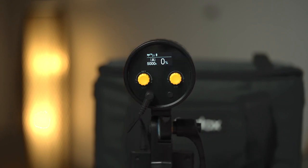This light is now mounted on the grip with two batteries. On the rear there's an on/off button, a power rotator, and a colour temperature dial. Power-wise, at 1% you can see the effect, and ramping it up to 100% it's extremely bright. Temperature-wise it goes from 2800K up to 6500K, which is a great range to match any ambient or other lighting you've got. The non-bi-colour version is just called the ML60 — the 'bi' means colour temperature control. The ML60 is a fixed daylight light but goes a little brighter at 13,000 lux versus 11,000 lux at one metre, though 11,000 is fine for me.